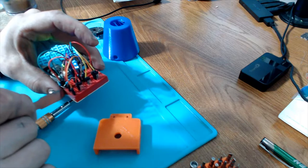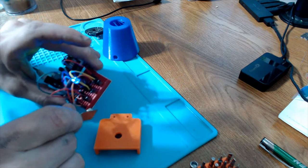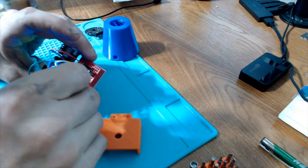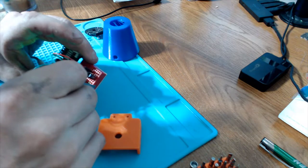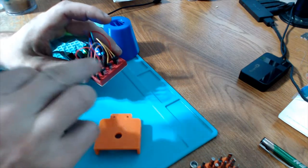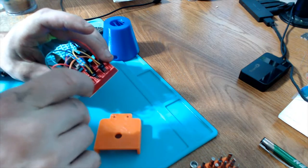Long story short, I'm going to have to use at least two voltage dividers. The green honestly isn't that big of a problem, but the blue gets extremely bright without any voltage divider. The red is probably alright where it is in terms of brightness. The blue needs to be toned back — it's going to have to go through a voltage divider to bring it down to probably around four volts to even everything out. So we're going to have to add voltage dividers to this design.